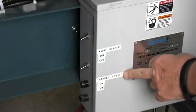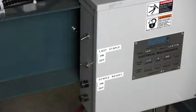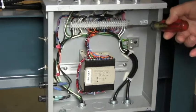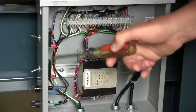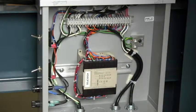There is also a staple adjust on and off switch. When the switch is on, there is an adjustment on the controller to change the spacing of the staples. When the switch is off, it is at the preset dimension of approximately 10 to 11 inches between staples. Inside the main electrical box there is a terminal strip with numbers, a PLC, a little controller, a couple of fuse holders.